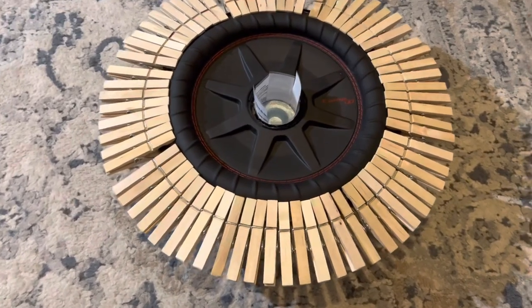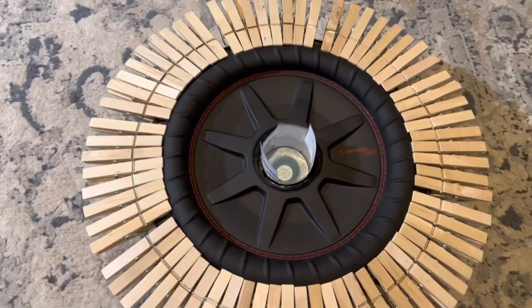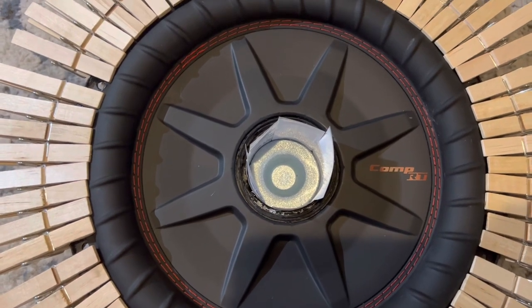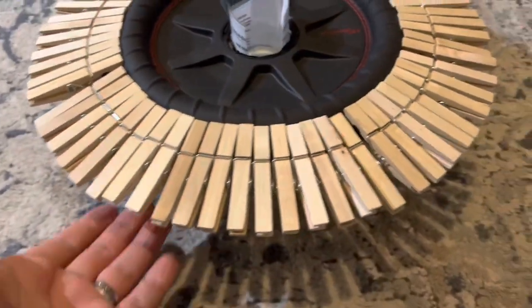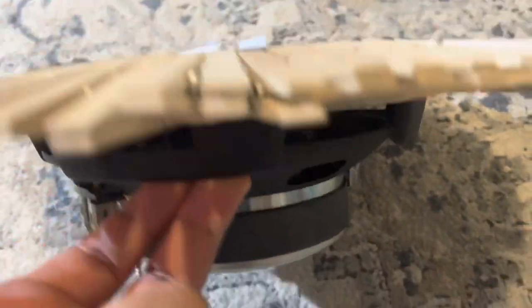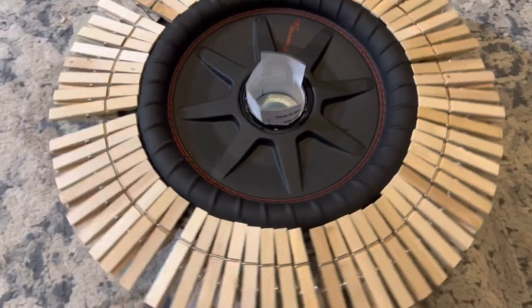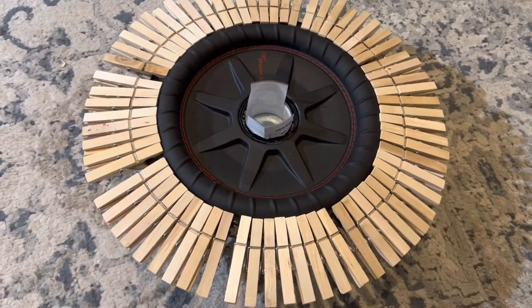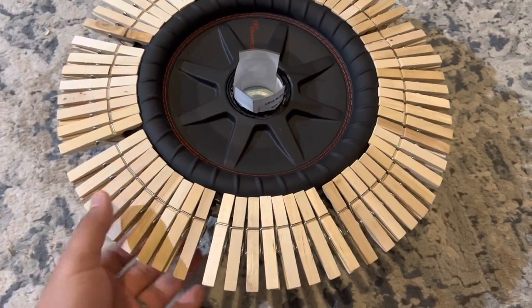Here it is. I've got the surround adhered with the clips, and I've got my spacers in between the voice coil, the coil assembly, and the center of the motor. That also included getting the spider adhered yesterday. What I want to do is take all these off and ensure that it is dry — it has been sitting overnight. I want to make sure the epoxy and both adhesives are really making a good connection before I apply any power.